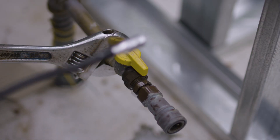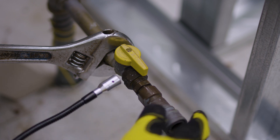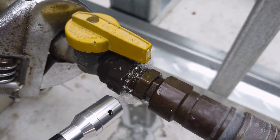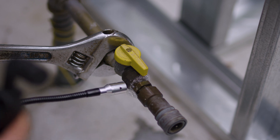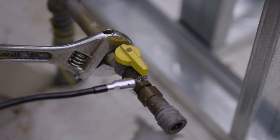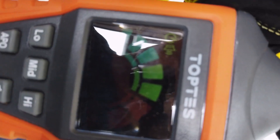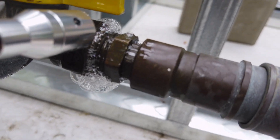There's the alarm! I'm going to tighten it back up and do it again. It's starting to bubble — no beeps. There it goes. So it is working. I would say it's not quite sensitive enough for this type of test. Initially there was just not enough gas leaking out to trigger the alarm. But as you can see from the bubbles, there was a leak before the alarm was triggered. It is going off even though I can't smell any gas. I would imagine being indoors or in a more confined space would be a better test for this compared to being outdoors.